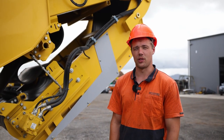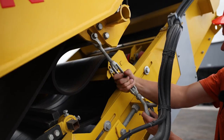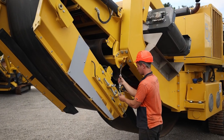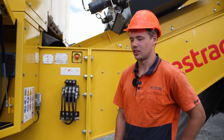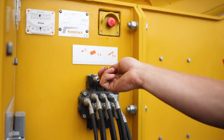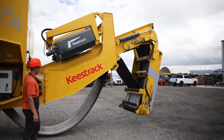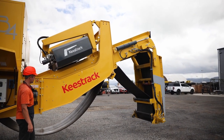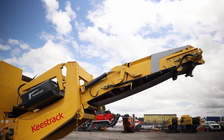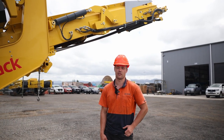The next step is to unfold the main conveyor. First, we need to unhook the safety supports for this conveyor on both ends. After you've unhooked the safety hooks, we come to this lever here and we unfold the main conveyor. Once you've finished folding out the conveyor, you need to insert the two bolts on each side to lock the conveyor in place.